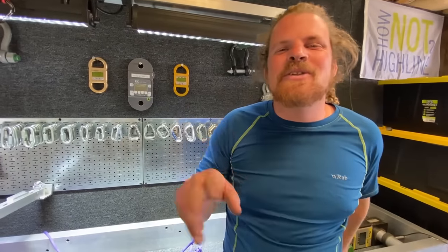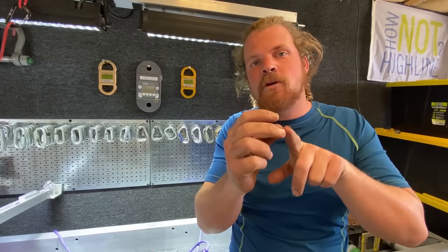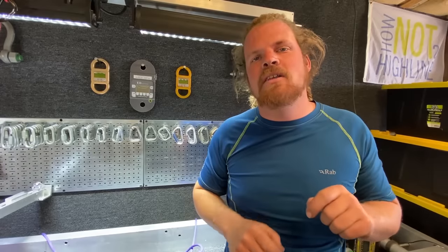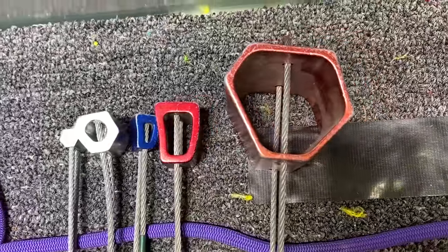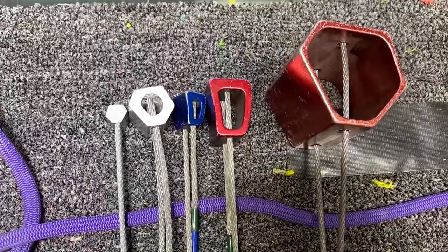Bobby had a thought and Ryan told him he had to be on camera to have thoughts. The difference in those results: the brassy has wires welded into the brass stopper at the top, so they don't have a bend radius there. All our other nuts had a bend radius right at the nut. So these are the five 10 kilonewton nuts and hexes we're going to test next — we're going to pop them all and then show you the carnage.